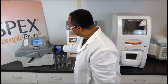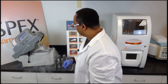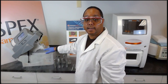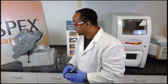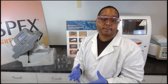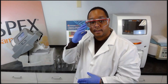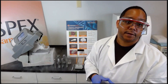To open the lid, we grab the latch, unhook, and release. The sample is chilled inside a bath of liquid nitrogen that embrittles the sample and allows the end plug to crush it and pulverize it to a powder. Liquid nitrogen is not considered a hazardous material, but proper personal protection equipment should be worn — cryogenic gloves, glasses or face shield, and a lab coat to protect the user.